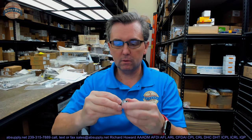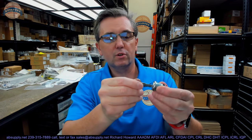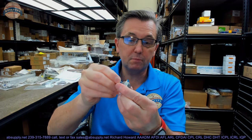It is simple, though it takes a little bit of patience. There is the cylinder retaining nut. The key will insert and it will rotate, but the key won't come out and the plug won't come out. There is a spring-loaded retaining clip inside. Right at the tip of my finger there is a small hole, and inside of there is that spring-loaded clip. I simply have a key ring here that I have bent so that I can insert it and depress that clip.